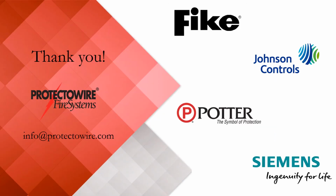In closing, we covered a lot of information today regarding the integration of Protectowire digital linear heat detectors into both Protectowire branded product as well as other manufacturers' equipment. Given Protectowire is defined as a normally open, resistive contact device, the max IDC wiring capabilities of a circuit, combined with the Class A versus Class B wiring configuration, are serious factors in deciding what control equipment to use. Different types of equipment are capable of supervising different Protectowire zone lengths. Some products offer capabilities in IDCs that can support extremely long zones of Protectowire.